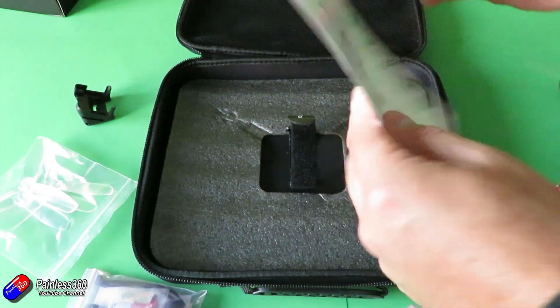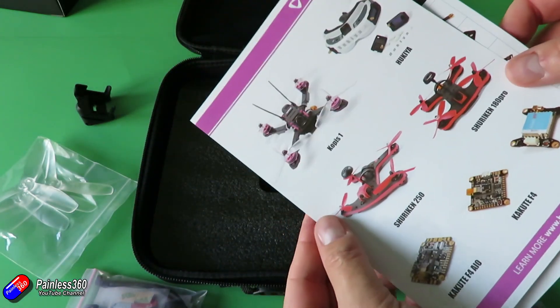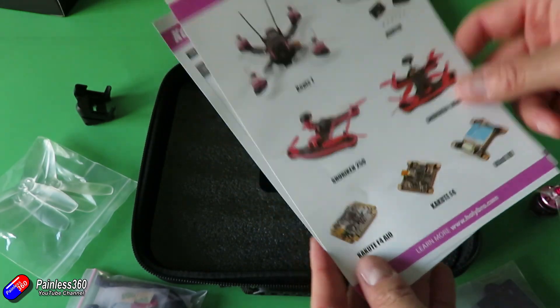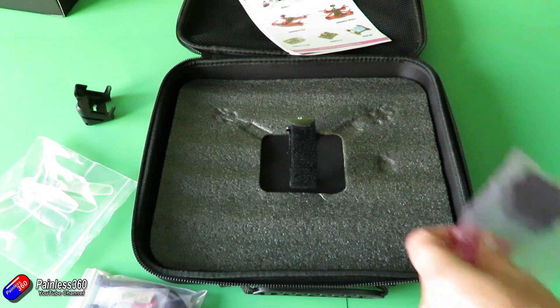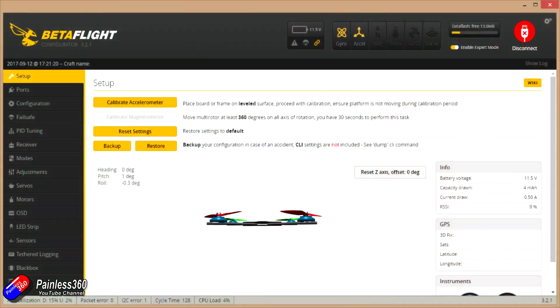So now we've had a look at that, let's very quickly jump into Betaflight and I'll show you what I found when I connected and just had a look around at the setup. I always recommend if you're going to get a bind and fly, you go in and check these things anyway. Standard USB connector at the side, plug that in and we're away. The nice thing you can spot straight away is in the top right hand corner there's some data in the data flash. That means that this flight controller has been armed and that probably means that there's been some kind of testing at the factory before this thing was shipped. Personally I always like to see a little bit of data in the data flash.